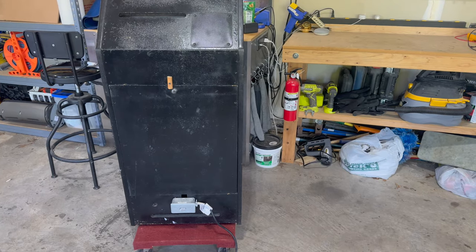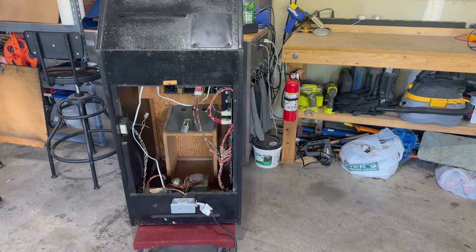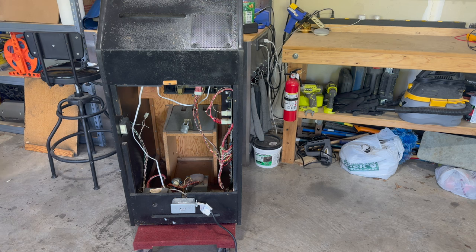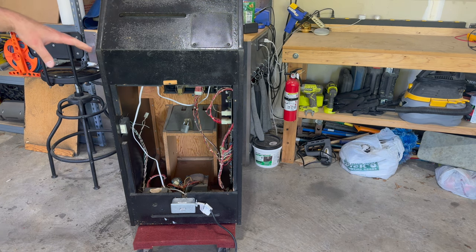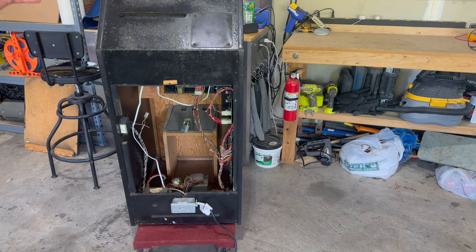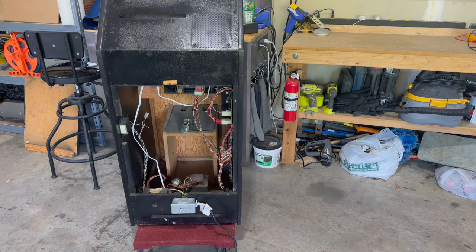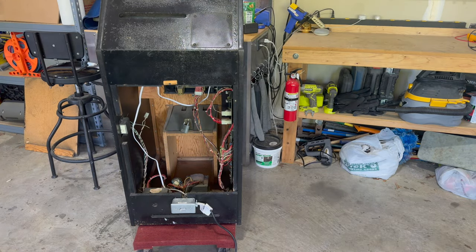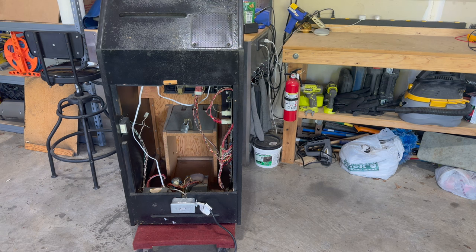One interesting thing I discovered recently - you know how in the previous video the image was sort of fading in and out, sometimes entirely to a blank screen, and I could bang on the side of the cabinet to bring the image back? Well, I was assuming that was a monitor issue. So I opened up the back door to watch it happening, thinking I would see the spot killer LED go on on the monitor. But in fact, I was seeing the LED on the game board go out, and wiggling the edge connector would create all kinds of noise on the speaker. So now I'm thinking maybe it's an edge connector issue - we'll clean that up too as part of this.